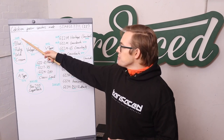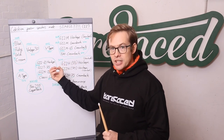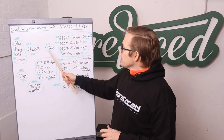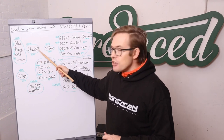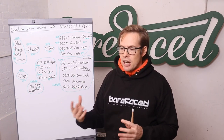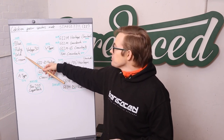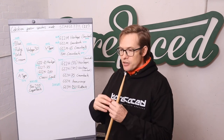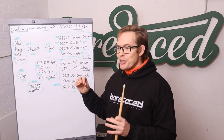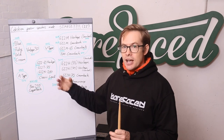It's a very loud speaker — 100 dB sensitivity — so there's a lot of magnetic flux, which means when you put electricity into it, it turns into more output than with a smaller magnet. It's got fair power handling at 60 watts and a lot of clarity. The complaint people occasionally have about the Vintage 30 is that it can be harsh in the highs, because it has the frequency response of the Alnico drivers — lots of output in the highs and mids — but without the Alnico magnet softening the edges, it won't sound as sweet.